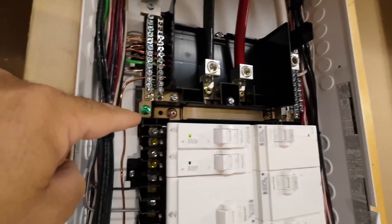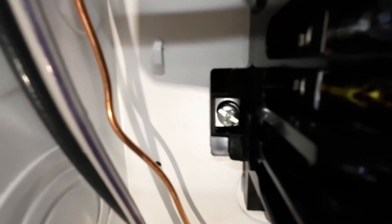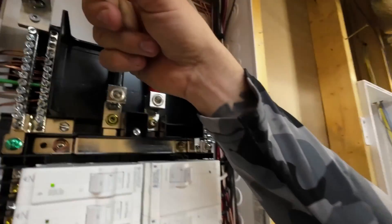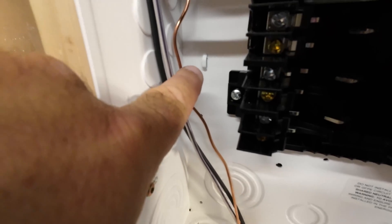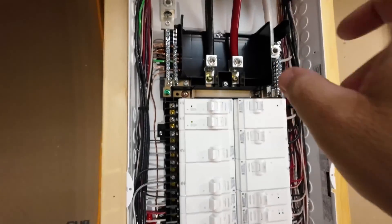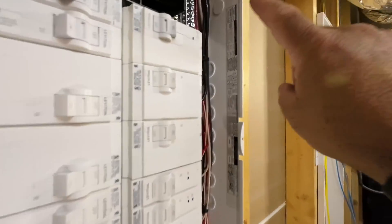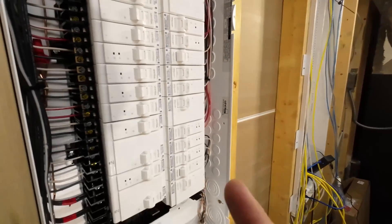So if you put a breaker in here you're going to go ahead and bond that, because most of the time it will be your main. Another thing Leviton has thought of — it looks like they've given us some tie-down points for your zip ties to make your panel makeup nice and pretty. They're all over the place — no one even told me about that. We're torqued up, and regarding torque ratings on these panels, look at the labels — that's how you're going to torque it up. Thank you Steve Cavallaris for telling us about the code on that.